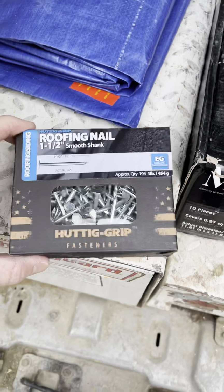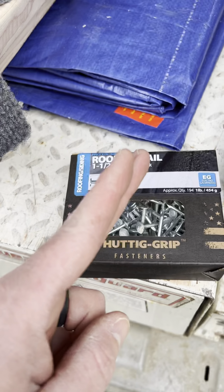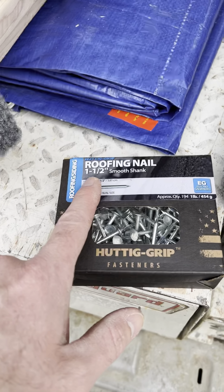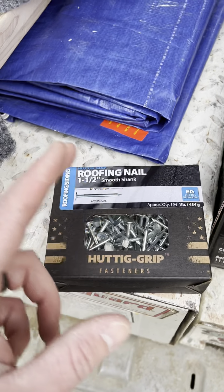When you do it, get nails that are at least 1.5 inches, so when you hold it in between your fingers and you bang it, you don't bang your fingers because it's a tight space. So get them that are a little longer than you think you need to get them. Because if they're 1.25 inches or smaller, you'll hit your fingertips.